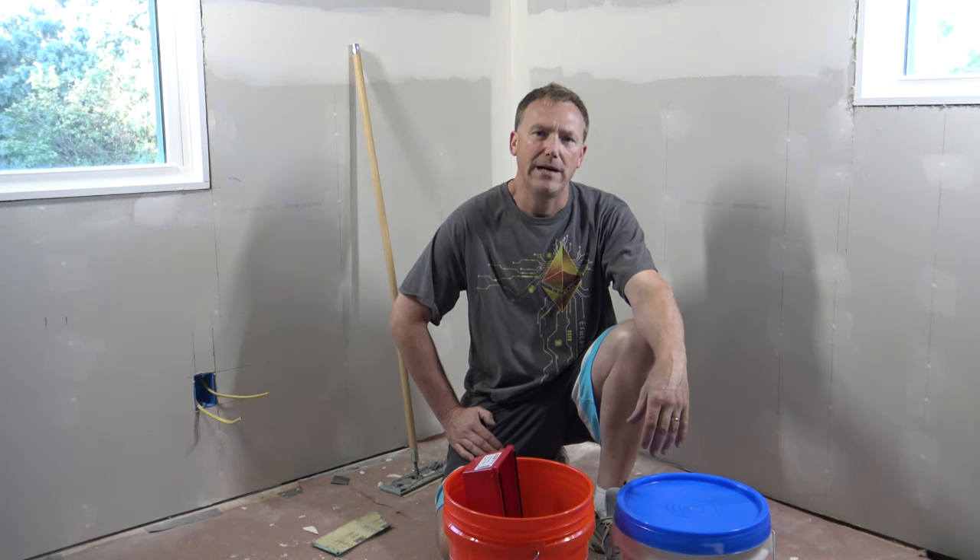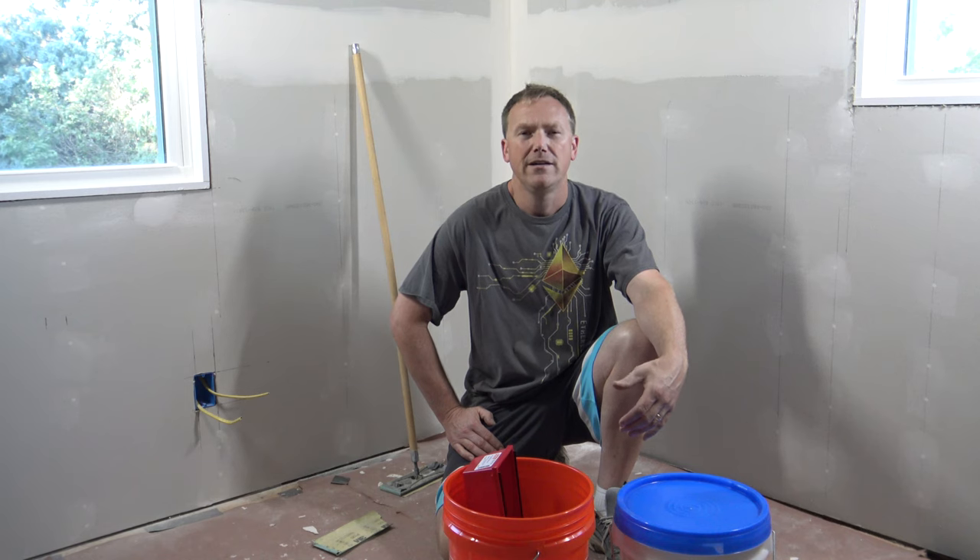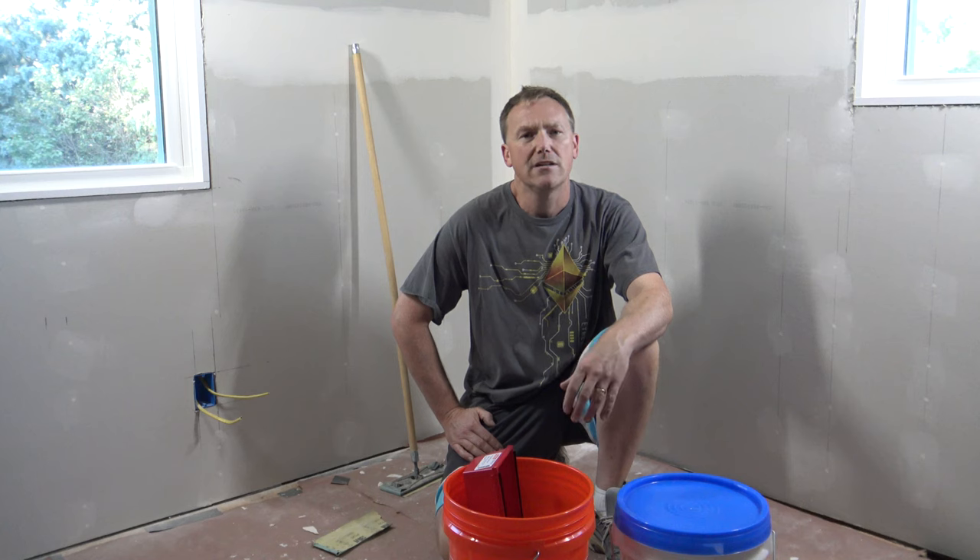If you're a do-it-yourselfer, I don't recommend buying the dry compound and mixing it yourself — you really need a big heavy-duty mixer for that. You can take this pre-mix; I'm going to show you the correct water-to-mix ratio, and you can mix it up with a cordless drill with a small paddle. Just remember: thin to win.